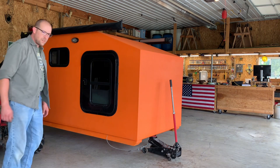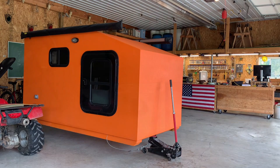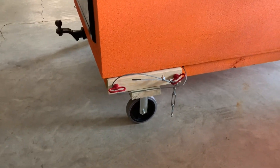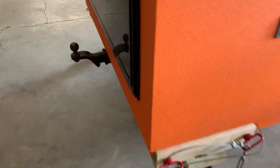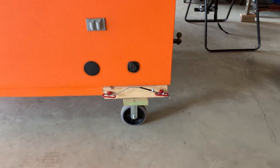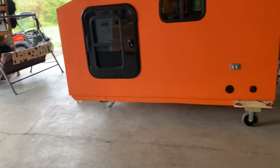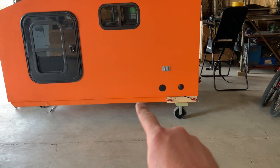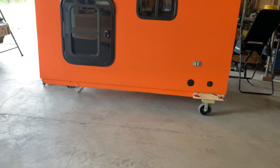Let's take a quick close look at the final product. Obviously that hitch will come out — it doesn't go there — but all of our weight is bearing through the wheel, up through the two by eight, and into the four by six crib on the bottom, being held in place by pins. When I go to put this back on the trailer, I'll be able to elevate the front, back the trailer underneath it, and then winch it on just like I had previously designed. When the trailer gets on to about here I'll be able to pull my pins and take my dolly off and winch it on the rest of the way. That is it for this video — it got pretty hot and humid out here, it's almost October but today is in the low 80s and humid. I appreciate you guys watching, we'll see you on the next one.